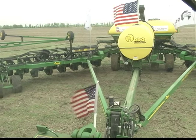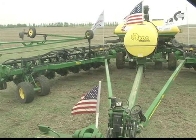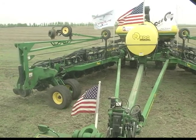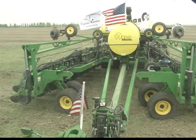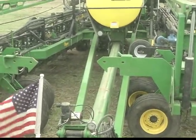This is kind of a critical spot in here. You just want to make sure that your tractor is rolling forward. You just want to make sure that you're not putting too much pressure on your wing walking tandems, that they're kind of staying in a gentle curve pattern, and the tractor is indeed rolling forward. Here's where you stop, when one wing is almost in contact with the triangular portion of the wing hanger.